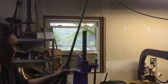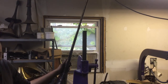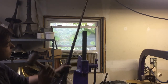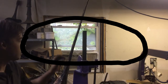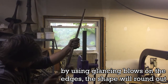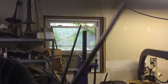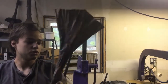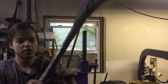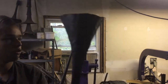Not a drawing mandrel — you don't want to hammer on drawing mandrels. It feels wrong, especially when you make your own drawing mandrel. So we're just going to hit on the corners of our rectangle here and balloon it out to roughly normal. We just rounded it out a little bit so that when we go to the power hammer we aren't going to be holding onto it and have it go sideways, which has happened to me and it really sucks. This is my 020 brass for my first double horn.